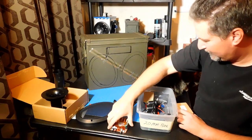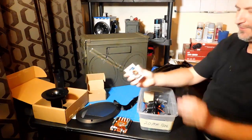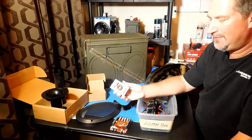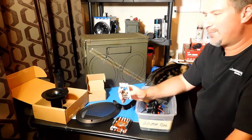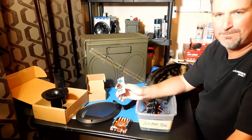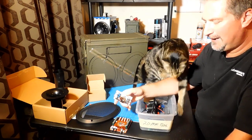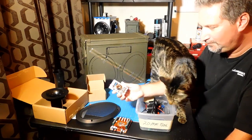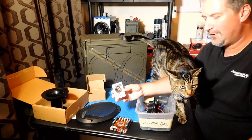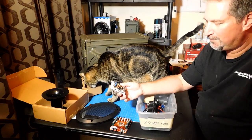When you do something like that, you're going to need a voltage booster. Now the ones in my previous videos — I learned the hard way those are good for about 24 volts. They're rated for 32 volts, but I found if you start cranking them up over 26 or 27 volts, I've had two of them have capacitors blow on me, and I did lose an amplifier when it blew. So I looked up this one — it's good for up to 60 volts, which is more than enough since I'm only going to crank it to 32 volts. It's a little more expensive — about $12 or $13 — but I think it's well worth the money.